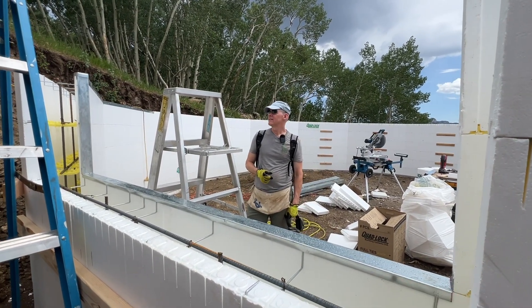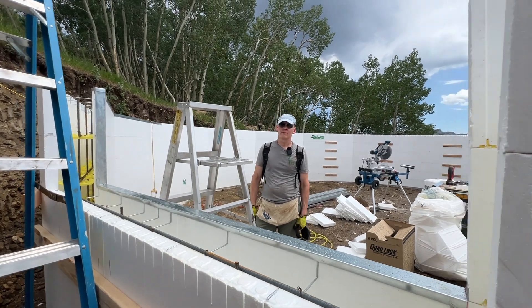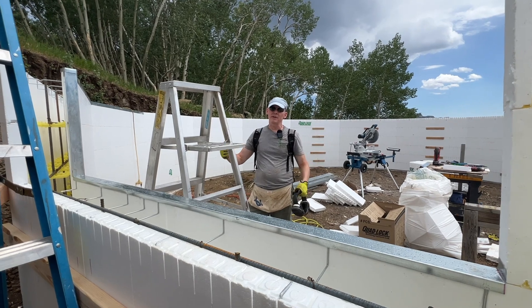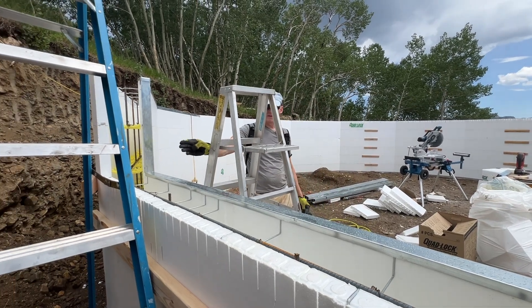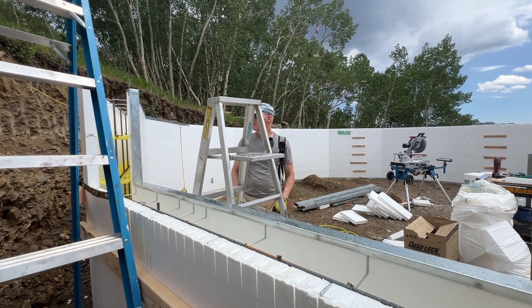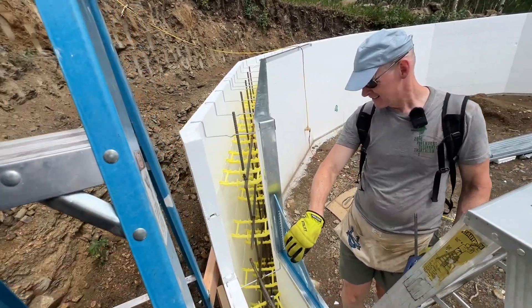This section has a little window here — it's only four levels high because this is where the door is going to be. The rest is the stem wall that the building's going to go on. I made it extra wide so we could drive the tractor through it. The rough opening for the door is smaller obviously, but we'll just build it out with some pressure treated to the proper rough opening later — that'll definitely be convenient.